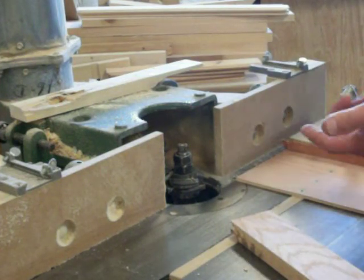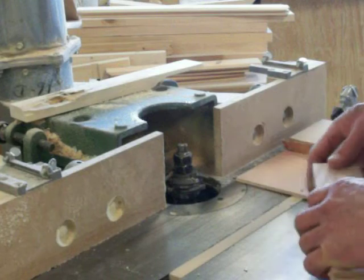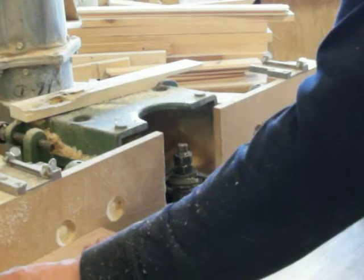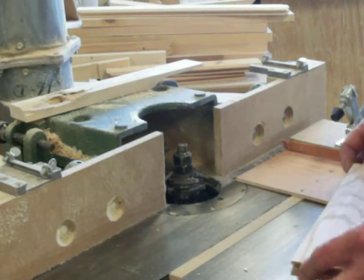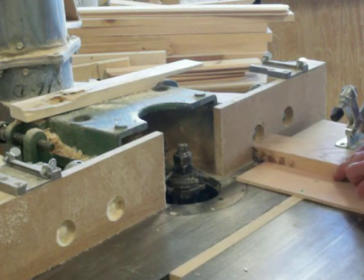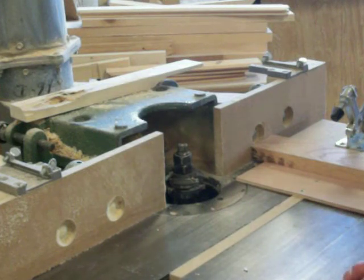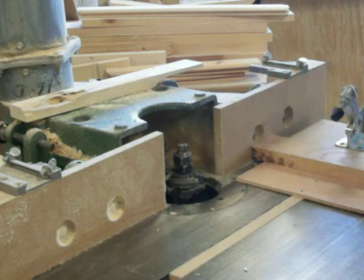They have to be flipped over, and like I said, they're going to be now pointing this way, so that my stiles will actually be fed in. I'll be feeding my stiles in this way to complete that cut all the way around. And that's the cope and stick on the shaper. And I'll be changing this over, and then we'll run our stiles.